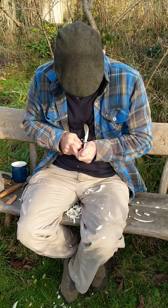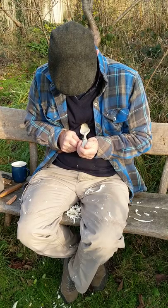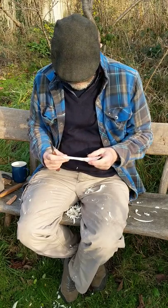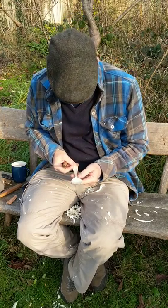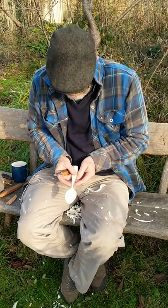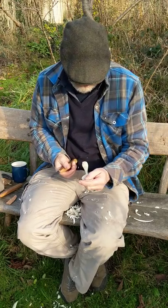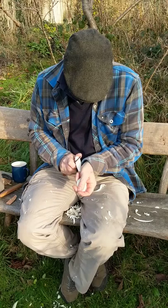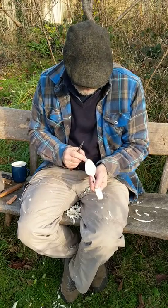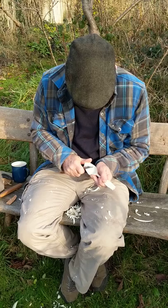I'll work out this transition. That visually makes the neck look a little bit thinner because it's thinned on top. As you go thin here, you've got to keep some depth there. I'm going to get a little shaping on the end of the handle. We've got a sharp edge all around there which can be liable to chip — this is a bit easier when the spoon's dry — but I can put a tiny bevel on around there.